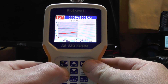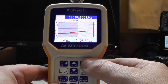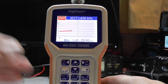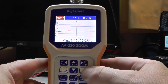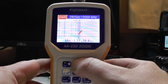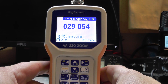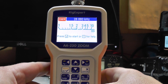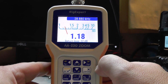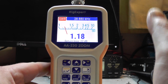I can press tick again to continue scanning higher up the band. Checking the minimum SWR - at 29.92 MHz it's about 1.45. My antenna is tuned more for 10 meters because the 10 meter band has been wide open. I can zoom in using the up and down arrows. Going back to SWR meter, I press 3 and enter a frequency - 28.880 MHz - press tick, and it shows at 28,880 kHz my return loss is 22 dB and SWR is 1.18. I've been playing around with this for a few days and there's still lots to learn.